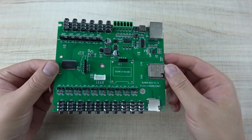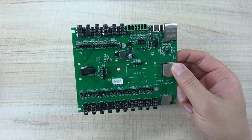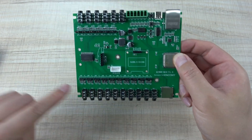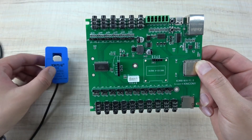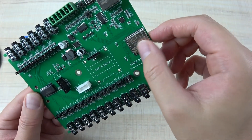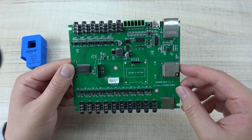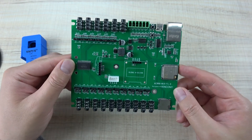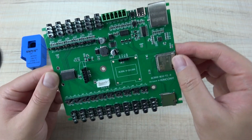This board is mainly used to monitor the sensor state of the energy meter. You can see there are 16 channel CT sensors. This is the CT sensor input, and it is also made with the ESP32. This board supports Home Assistant via ESP-Home, and also supports writing any Arduino code downloaded to the ESP32 module.